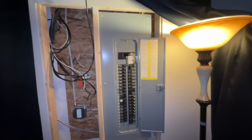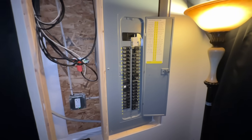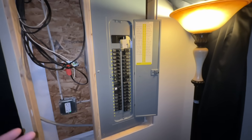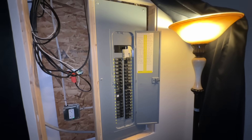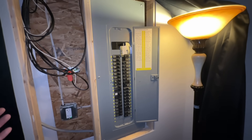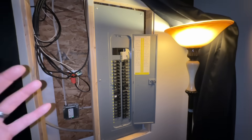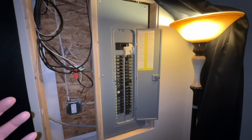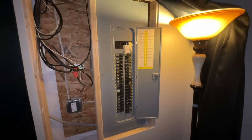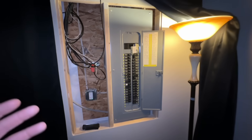Whatever items you don't plan on running, make sure you shut them off at the breaker box. If I had every light on in the house the generator probably wouldn't be strong enough to run everything. But for the things I want — refrigerators, freezer, furnace, hot water tank, a few TVs, lights, a microwave, a fan — as long as your generator's wattage covers the total watts you plan to use, this system works perfectly fine.